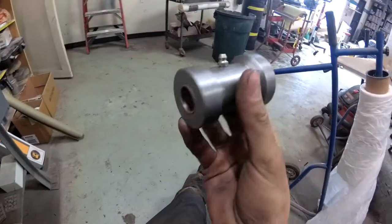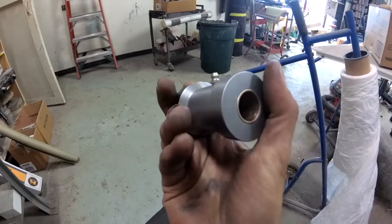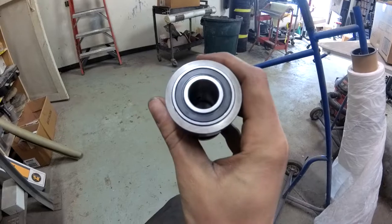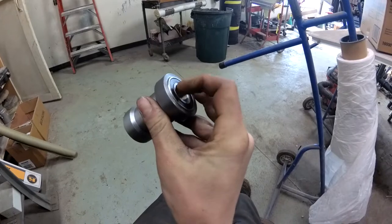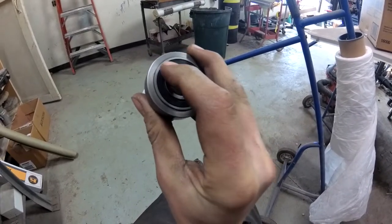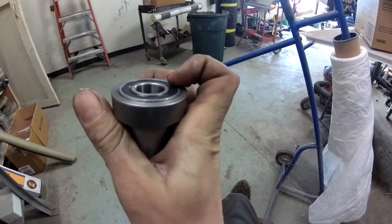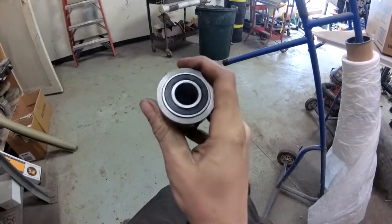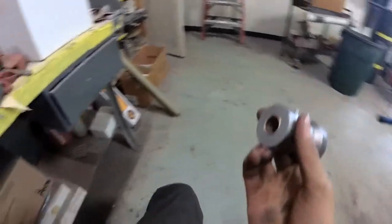I got everything pressed in — the oil-lite bushings are in there. I wish I could have found a two-inch long one but it's one inch, it'll work — doesn't go all the way through, whatever. Bearings are in there. I had to cobble a little bit — there's a spacer in there. I didn't design the bearing cup quite right, so the inner race was going to hit if pressed all the way in. There's a little spacer around the outside that keeps it up a bit — it'll be fine. Everything's red loctited in, grease fittings in there. These came out really good.